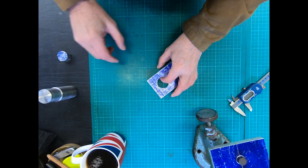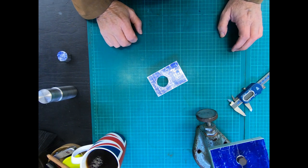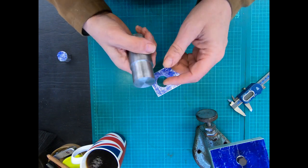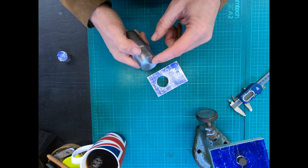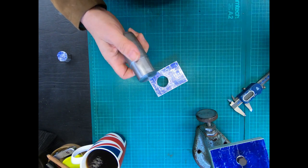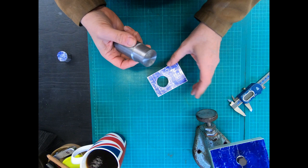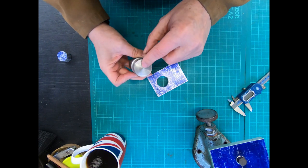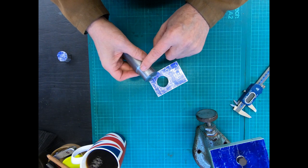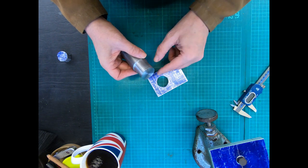I've been filing away and trying to bring it to size. One of the things I decided to do was take a bit of steel and turn it down to a smaller size. We're looking for 35mm, so I've turned this down to just under 34mm, and I'm filing the workpiece to match this gauge piece. It gives me a bit of leeway to try and get the circular form that I need, and once I'm there on 34mm I'll turn the final piece down a bit on the end.